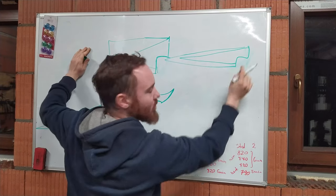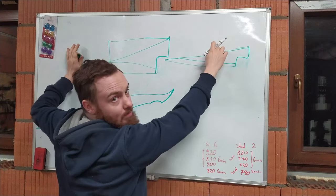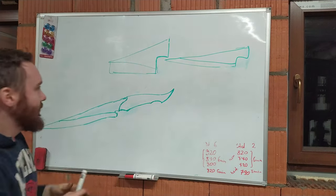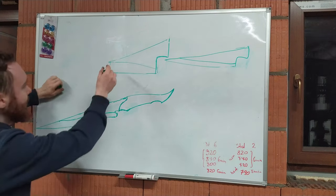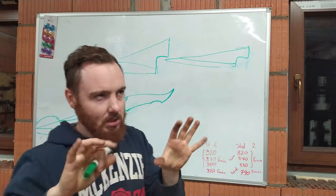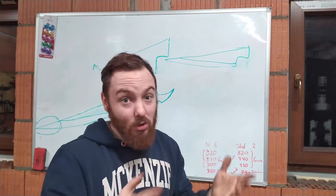So this is going to be the star, but I don't want to make this area black — I want to make the pattern go from the spine to part of the bevel. That is why I need to remove this material during the forging. After I remove it, the top of the billet becomes the spine, and this area gets pushed — this is going to be exactly this part of the knife. So I believe this is going to be something like a semi-san-mai with Damascus scales but on the integral bolster.